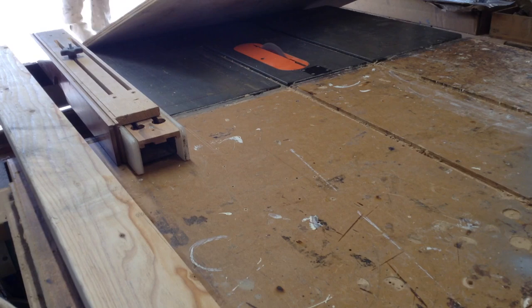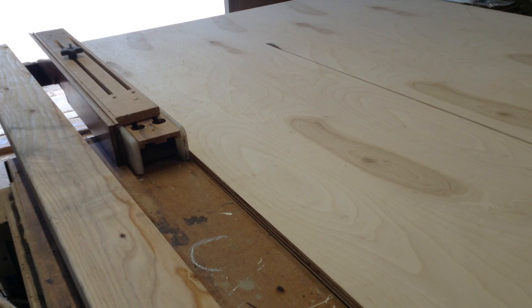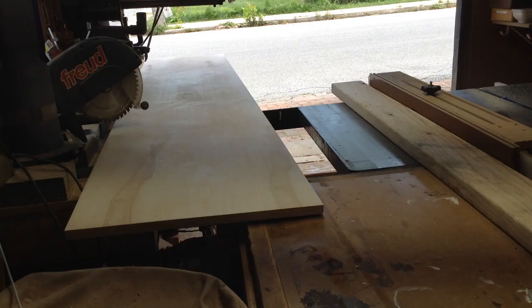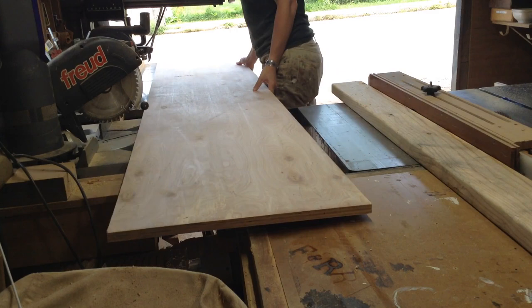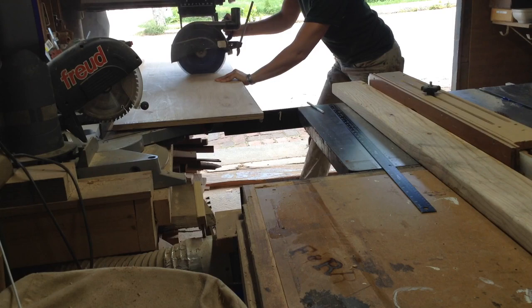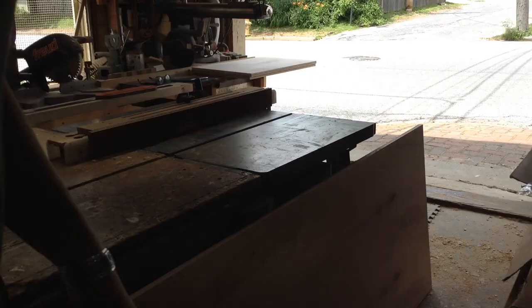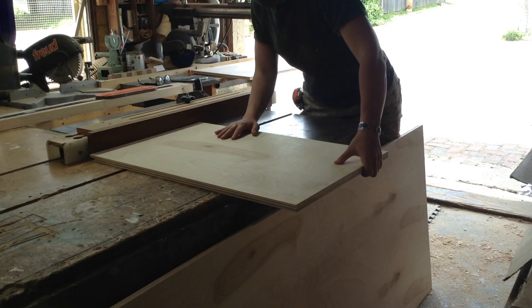The basic gist of the center unit is that it's a cabinet with two huge drawers. Even the two side desks are built like paneled cabinets because they're not legs — the sides are panels, not hollow legs. So I start by ripping down my pieces. This piece of furniture has very specific measurements: it can't be more than 19 inches deep, the center portion is 40 inches wide, and the whole thing is 30 inches off the ground. I'm ripping down nicer grade cabinet veneer plywood — the veneer is maple, which is what they sell at my local Lowe's.